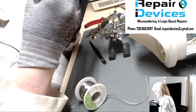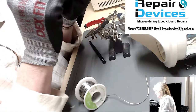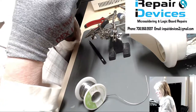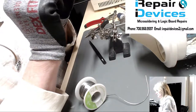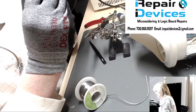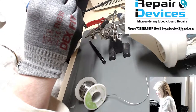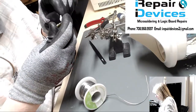The bottom is sitting a wee bit high for my liking. I'm tapping the bottom leg here, and as the solder melts I'm just pushing it down. That looks good. Now I'm just going to go ahead and clean up my area, remove all the flux and residue.